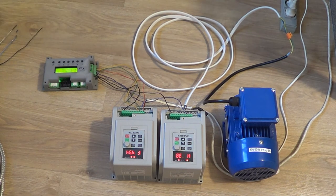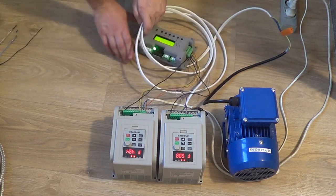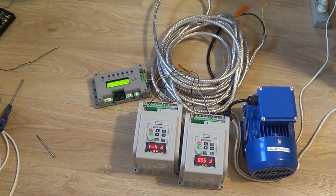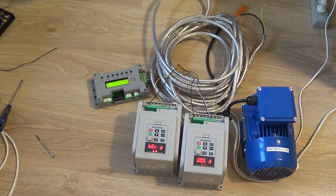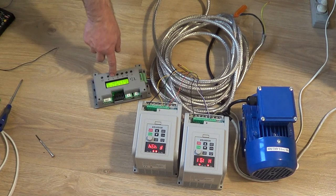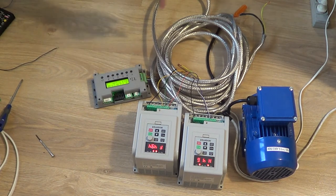In such an easy way you'll create a lot of frustration. This is the most important reason why you have to make sure all your wires are routed correctly, or just use shielded cables. They are pretty expensive, but they solve a lot of problems. Here it's a bit messy, sorry for that, but this shielded cable is expensive so I just made a loop with it and put our controller and signal cables through the loop — and even through the loop with this kind of cable, you don't have any problems. You can see on the inverter display it's reacting fine.